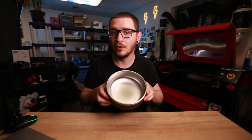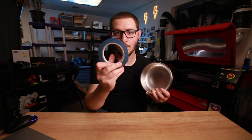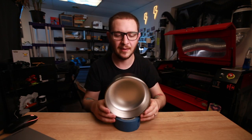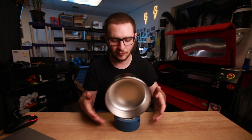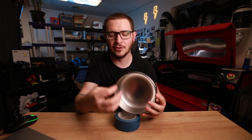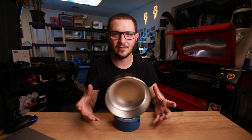In order to get our dog bowl engraved we need something to hold it upright, because if we just set this on the fiber table it's going to move. All you need is a roll of tape - it'll do an excellent job keeping this still. You'll have to fidget with it a little to get things level once it's under the fiber laser. You don't need a fancy rotary tool or a special jig; a roll of tape is going to do great.